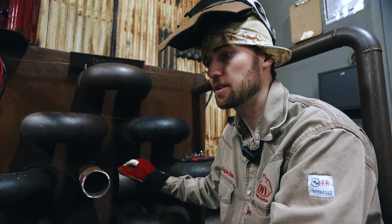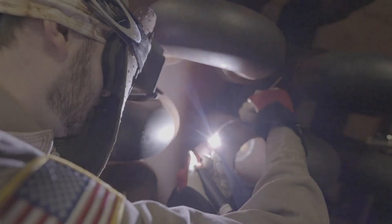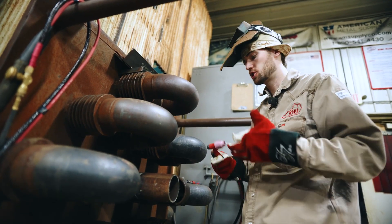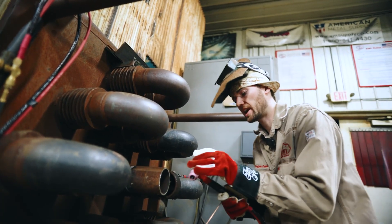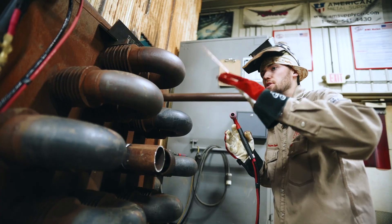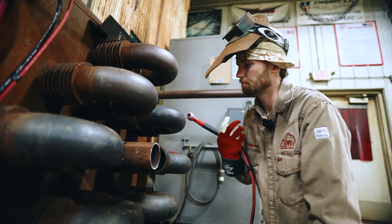The weld is in a tight space for a reason — you don't want to have to go back and do it again. Just make sure if you're doing a weld in a tight spot, do it once, do it right, so nobody else including yourself has to come back and fix it. We got the last quarter of this weld to go. We're just putting the root in, showing you the technical aspect of these simulators and how it brings the real-world feel to your learning experience. You want to have the right TIG rig with a shorter cap that can move freely and flow argon without issues. Make sure your TIG rig is hooked up, your ground is hooked up, everything's ready to go before you start. You don't want to get started and then have to go get something. Make sure your wire's up there, your argon's good, your machine's good, you got your remote — everything's set up before you make these welds, and that's going to make your whole experience a lot better.